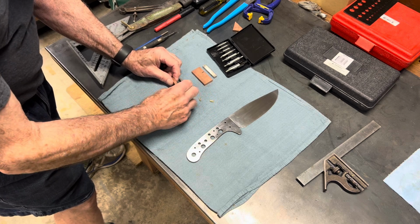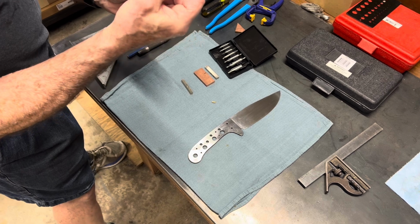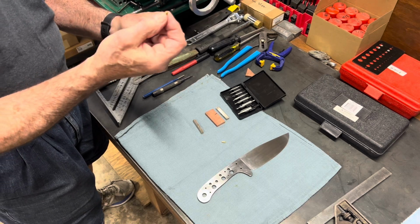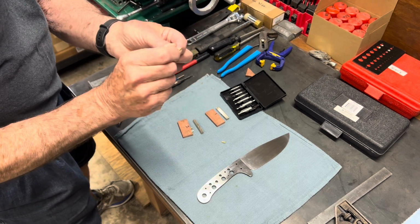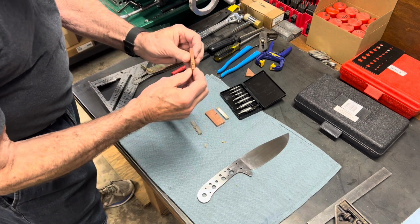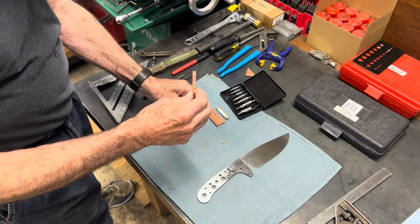which, by the way, if you ever tried to make short pins like this with rounded edges so they don't catch, just manufacturing these little pins took me about an hour, with about 4 of them lost someplace on the floor and kicked underneath my gear, because they're hard to hold on to. I mean, you can't just hold them like this and run them through the grinder. Very difficult to do. Anyway, manufacture the pins, set them in the holes, and now you can see there's a lot of wiggle in there. A lot of wiggle. Grind those holes out so that the pieces would fit.